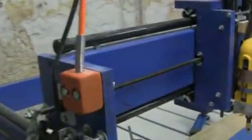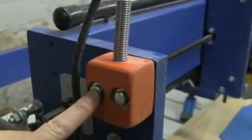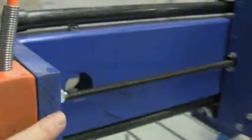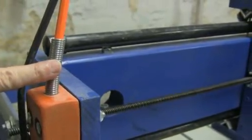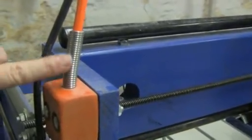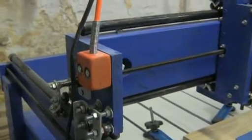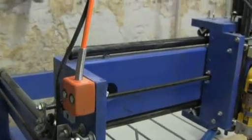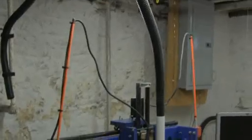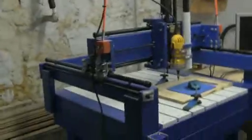All of this is a little wooden block mounted to the gantry. I used quarter-inch diameter bolts that are countersunk and go all the way through. Then there's a spring that gets mounted in here — it's a half-inch outer diameter spring, 0.072 gauge wire, and it's four inches long. What this orange rod is, is nothing more than a piece of marker rod that you use on your driveway to mark your driveway. Here in the Midwest we get a lot of snow, so they mark the driveway so you know where to drive. I use one of these rods — they're a fiberglass rod — and I cut this down to around 20 inches long. Let's go over to the bench and I'll show you how it's all put together.